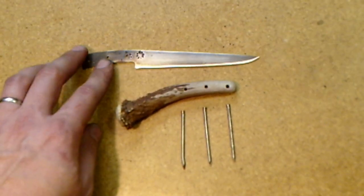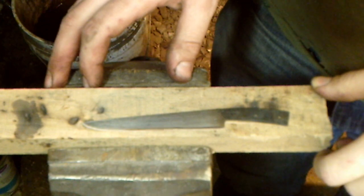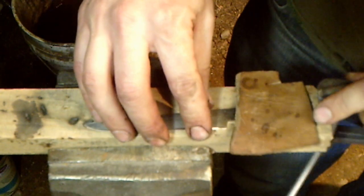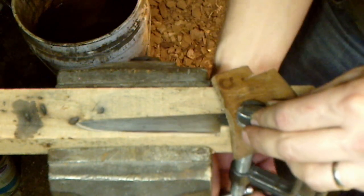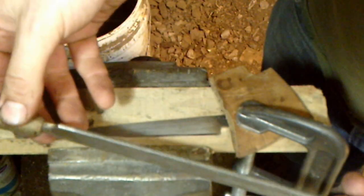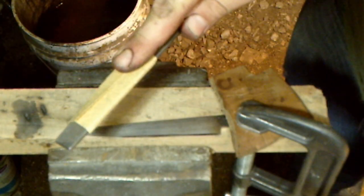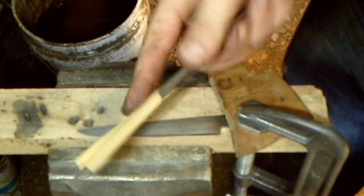What I've got here is a scrap piece of wood mounted in the vise - it can be whatever width and length you need to accommodate the blade size you're working on. The blade sits on there, and then I'll take a C-clamp, put a little piece of leather at the back of the knife to keep it from sliding around, get the cutting edge up close to the edge of the board, and tighten it down. Then hand sanding - I just take a file to back my sandpaper and roll it around. With that backing you can generate a lot of force and do the most work finishing the blade.